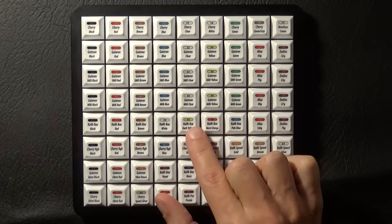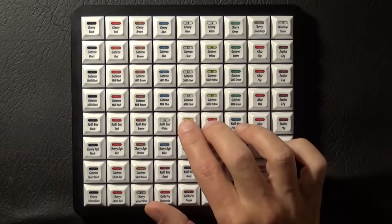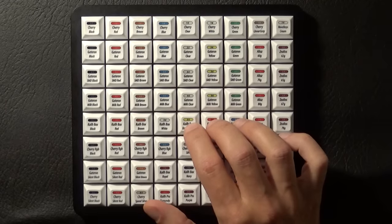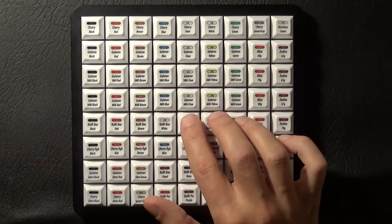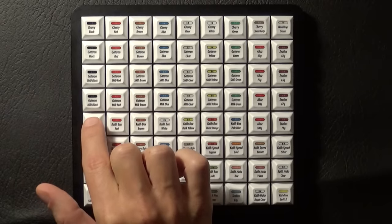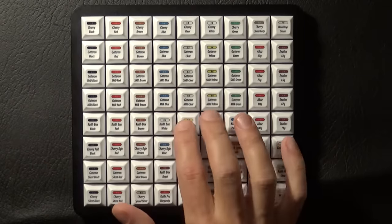And here's Kailh box dark yellow, the linear one. Actuation force 70 grams and the actuation point 1.8 millimeters, just like the other Kailh box switches. So 70 is actually quite heavy, 10 more grams than the black one. So it's not like the Gateron yellow that was in between red and black. This one is actually heavier than the black one.